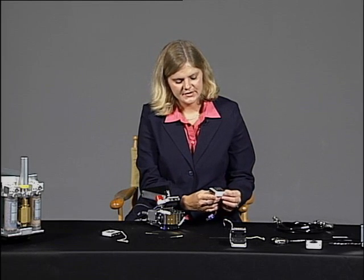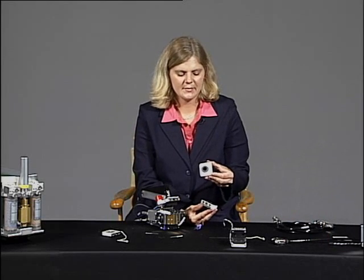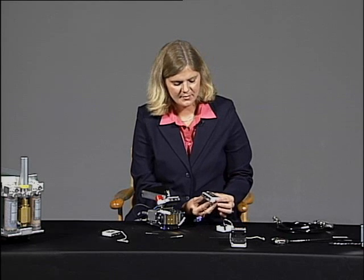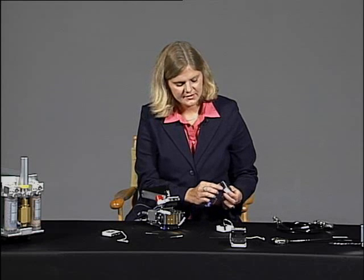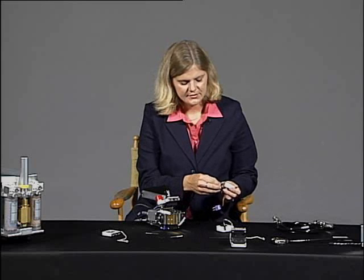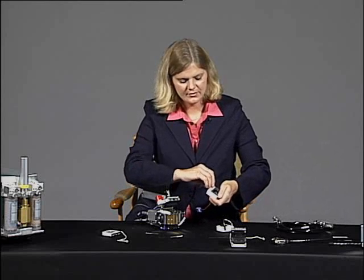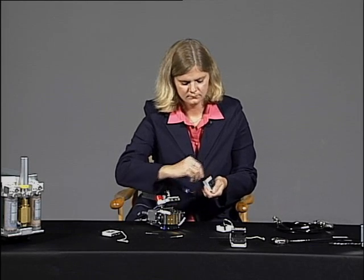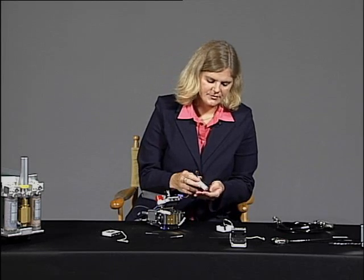Now, to install our fluorometer, you'll notice the fluorometer has its own chamber bottom, and we are going to replace our standard chamber bottom with that particular bottom. But we need to reuse our O-rings, our screws, and our thermocouple. So first, remove your O-rings from the standard bottom chamber and place them on your table. Then you can remove your screws